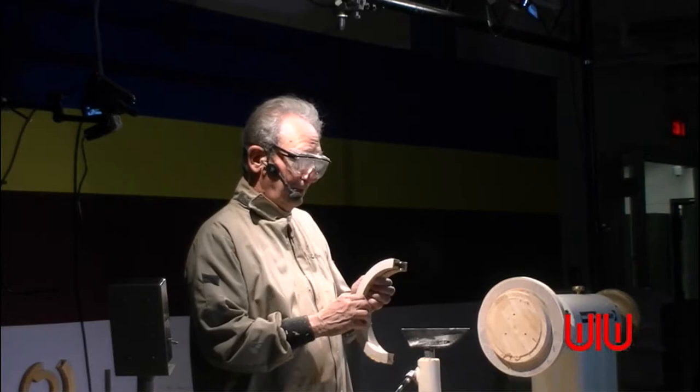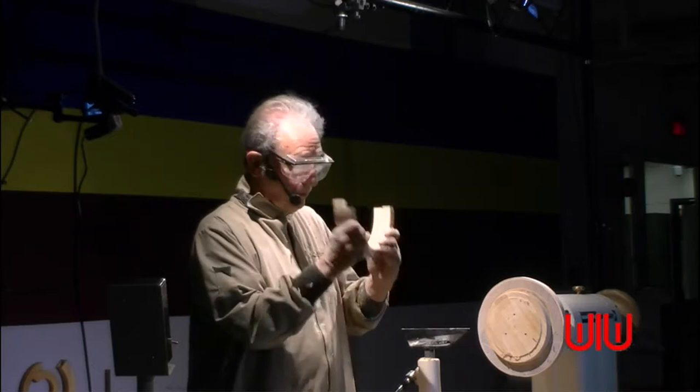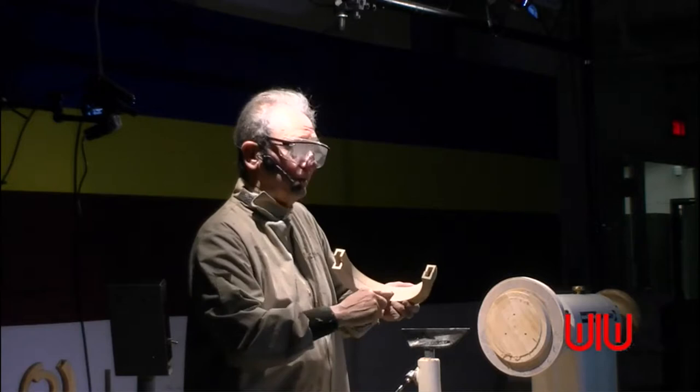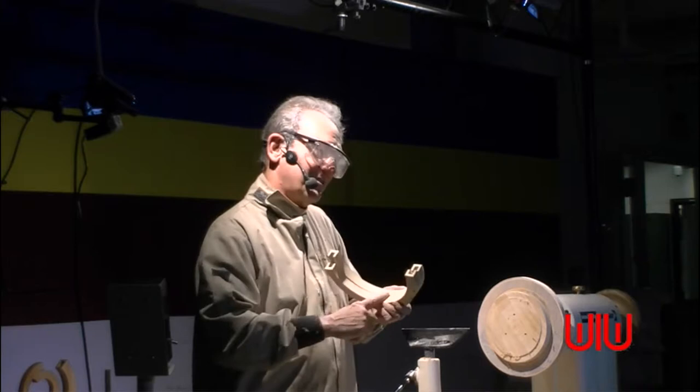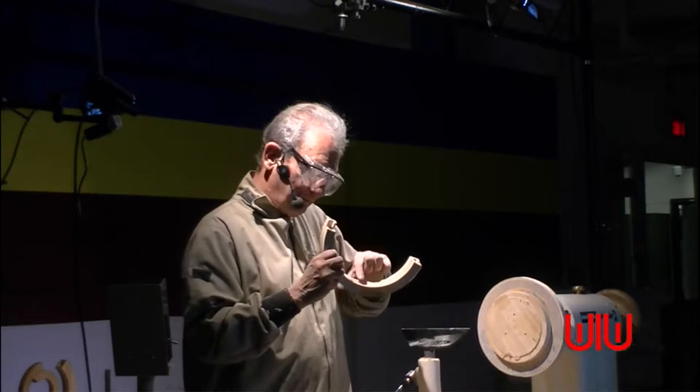When you glue them together, see, I didn't measure my center properly. These ends should be closer together, but it doesn't matter, you can always adjust it afterwards. When you're gluing it together, focus more on the inner surface, the inner joint here, because it's hard to sand on the inside sometimes. So, focus your attention on the joint on the inside here. If that lines up properly, so should the outside. Okay? But I focus on the inside because that's where I have most trouble sanding.